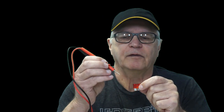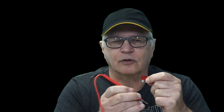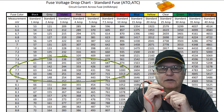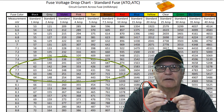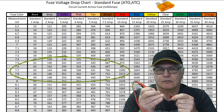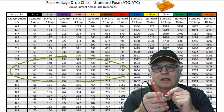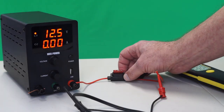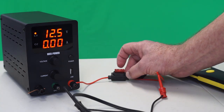You're familiar with measuring voltage drop across a fuse to confirm whether there's any current going across it. But we can do better than that — by using a chart like this, it can tell you how much current. For every 1000 milliamps, which is one amp, a fuse like this would show a 7.7 millivolt voltage drop. I've written a small test here that's going to show one of those times when we're trying to get millivolt accuracy out of a multimeter.